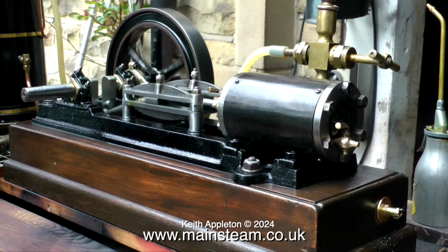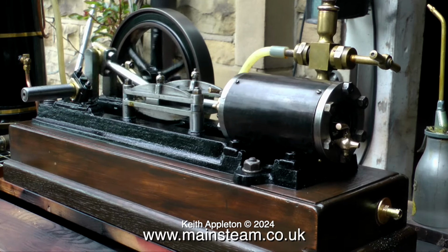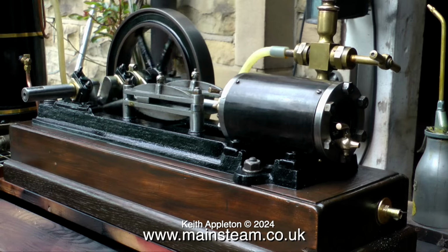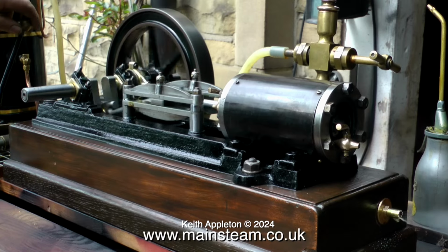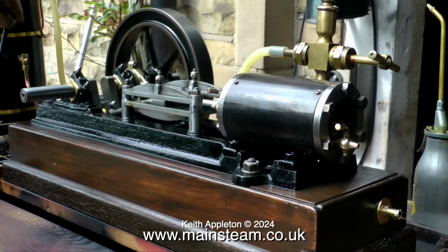And all you have to do is hit the area of the engine where the shuttle piston lives with a heavy screwdriver, preferably a plastic coated one so you don't damage the engine, and you will see that it frees and the engine runs perfectly. So I'm going to modify this boiler plant so that the steam pump is fed from a non-superheated source. And that, in conjunction with a bit more running in of the pump in general, should make it work perfectly.